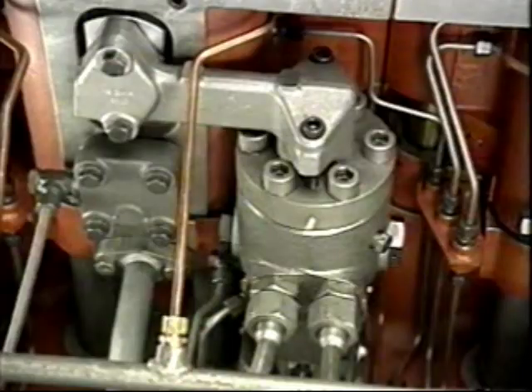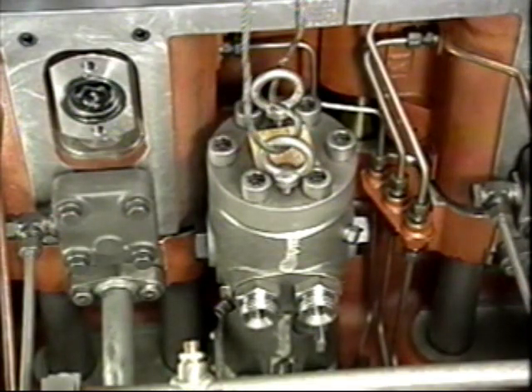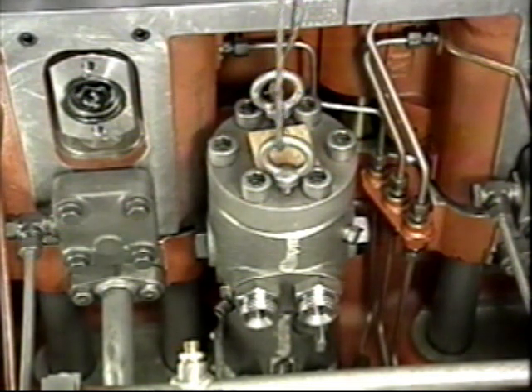Next, fuel oil injection pump maintenance. Remove the injection block, the fuel intake and outlet tubes and the various pipes. Block the fuel oil main pipe and remove the fuel injection pump from the engine.